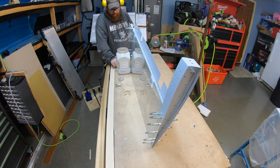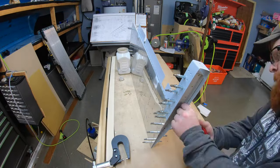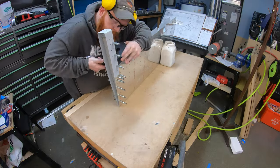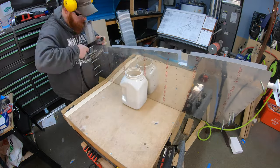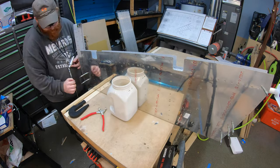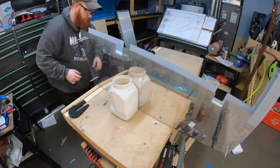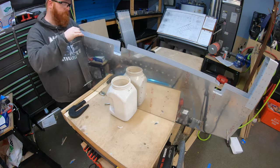Here I'm just closing up the ends. No real tricks - just as I get to the trailing edge of the ends, I ran out of space. I was able to set the very last top rivet on the trailing edges of both sides, but then I didn't have enough space between the shop head of the top rivet to get the squeezer in there to get the bottom rivet. So I just did a pull rivet on that bottom.